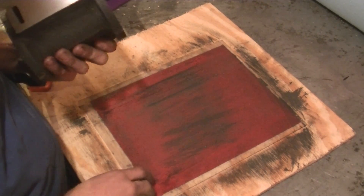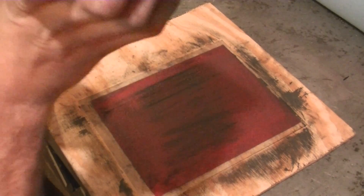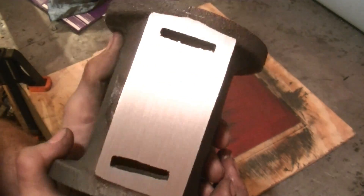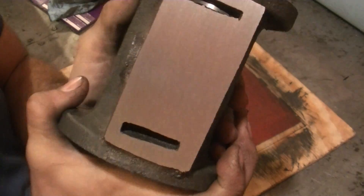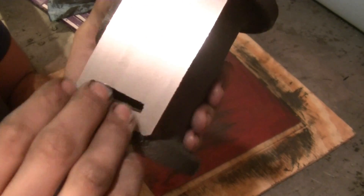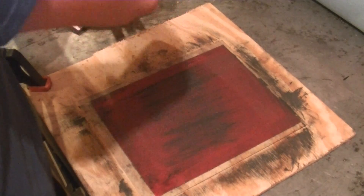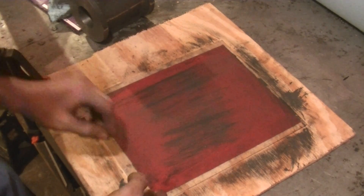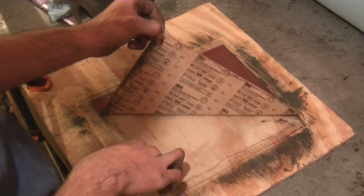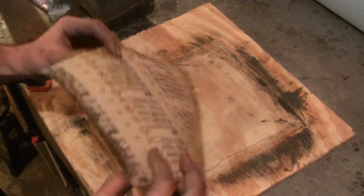I went through four of these papers and maybe it's about an hour later — we have this surface finish. Pretty nice, very nice surface finish. Next I'm going to step it up in grit size and see if it changes the finish significantly. If it doesn't, I'll just stop. If it does, I'll keep going until I get to 400. So that was 150 grit.